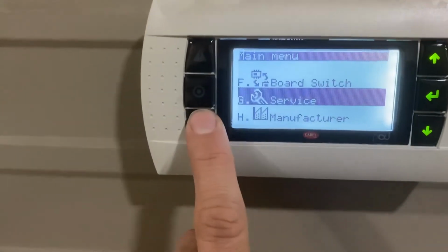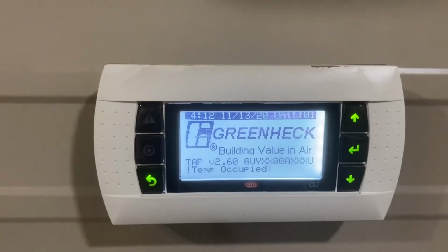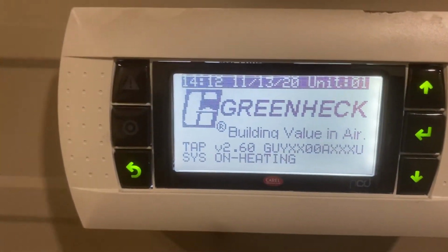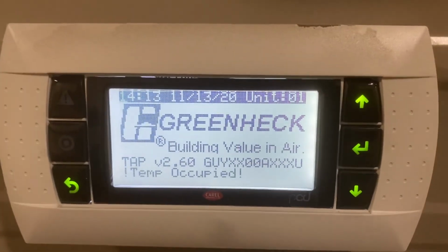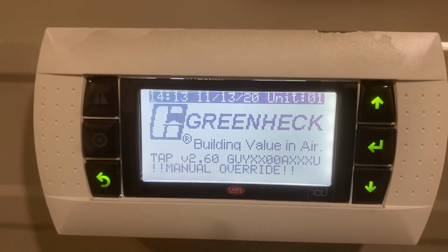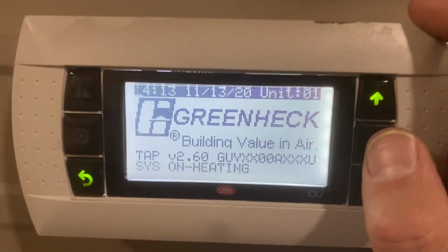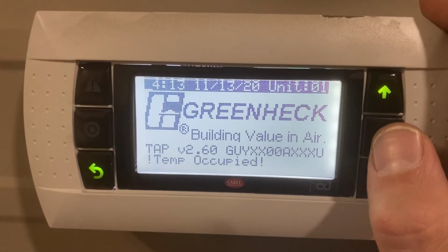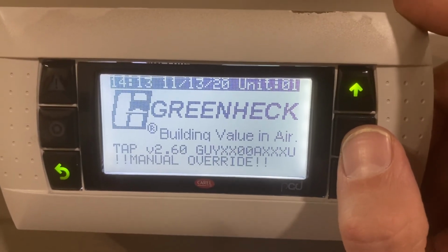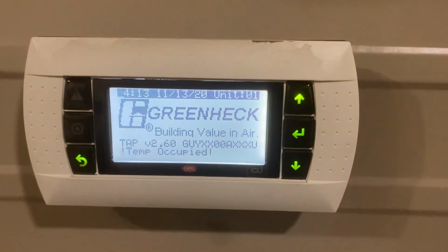That is basically our entire setup with this controller and how we've got it set. We've got our discharge temp, we've got our room temp, we've got our outdoor air temp offset so that it will not turn off when our temperature comes up, and that's because we've got an outside air temp also acting as a room temp. So I'm gonna do a second video and I'm gonna show you an override menu, and we will be there in a sec.